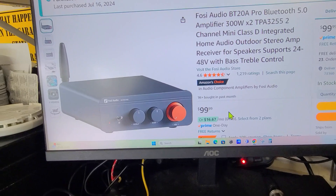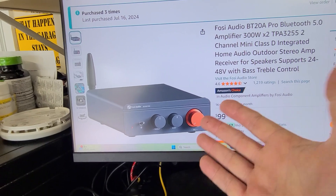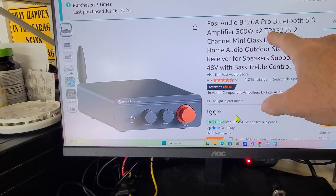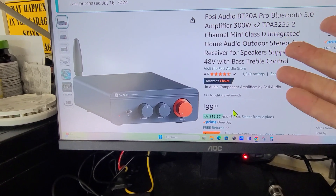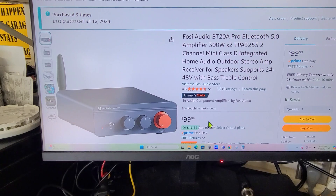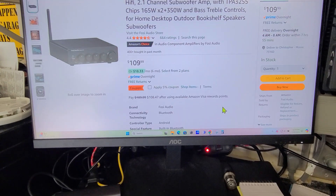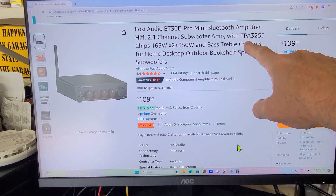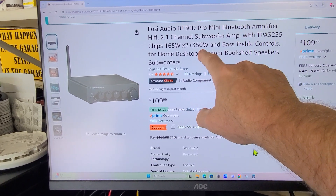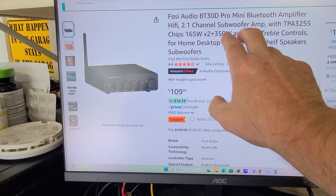You could marry this amp up using its preamp out — since it's variable — and have the other amplifier run the subs at 600 watts or more. And if you really want to go crazy, make a subwoofer amplifier with four of these chips and make it a true 1000-watt subwoofer amplifier. With two TPA3255s — one for the main speakers and one dedicated just for the subwoofer — it's just about there; it just needs more of it.